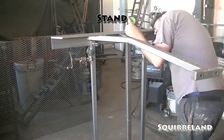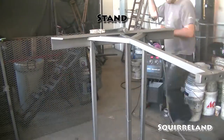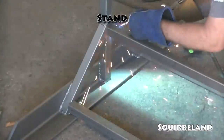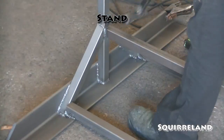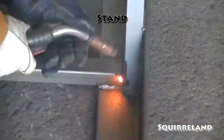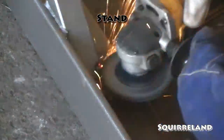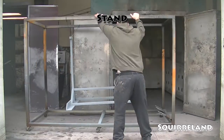For anyone who is wondering, I didn't really have enough room in my little shipping container shop to assemble this thing and still have room to comfortably walk around it, so that's why I'm out here in the big boy shop for final assembly. Lastly, I just need to weld on some caps to the open ends of these tubes and grind off any extra. Now it's time for the powder coat — just like before, I have a primer layer lightly baked on, and I think I picked a color that will definitely complement the color of the two rings.